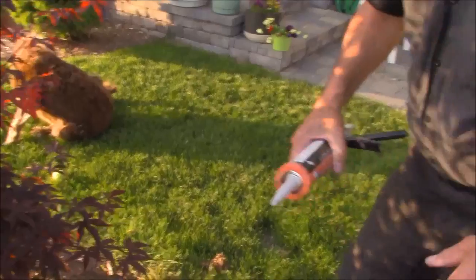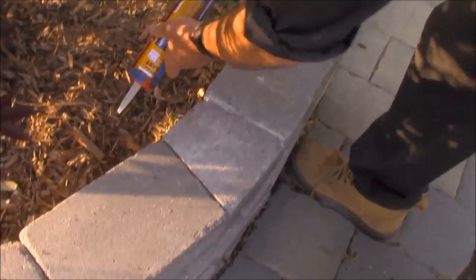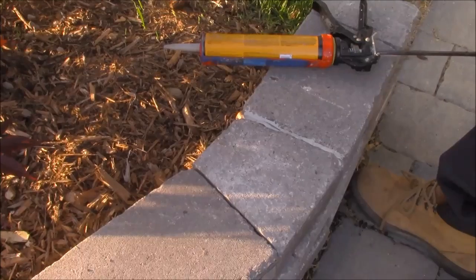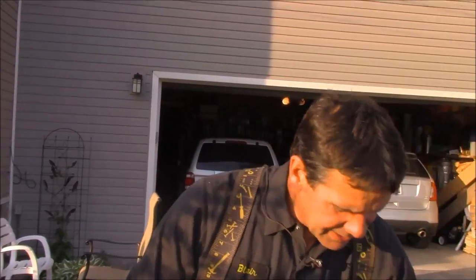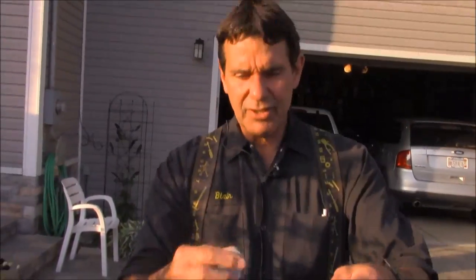So that's gun-grade — it's thick like putty. I've got a little control; I can put it on a vertical surface and it'll stay. Self-leveling is a little harder to deal with. We might even have to waste a little just to get the tip full. Get a napkin so I can clean as I work — towels around caulking. I like to tear them into pieces that make finger wipes, so I can take small pieces of paper towel, wipe the caulking off the surface or my fingers, and throw that little bit away.